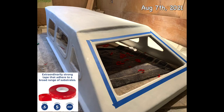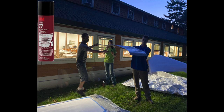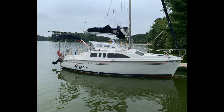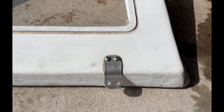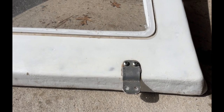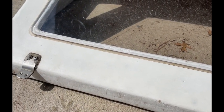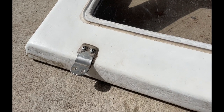To adhere the windows to the Dodger, I used 3M VHB tape and painter's tape to align the windows. I also used 3M spray adhesive to ensure that the self-adhering foam deck material would stay stuck to the top of the Dodger. Our final window to install was the aft window — it took special care and a few piano hinges to ensure no mosquitoes could find their way in when it was closed. One of the final challenges was to fabricate stainless tabs to secure the Dodger to the existing mounting holes of the original companionway hatch. Using the original hinges as a template, I bent the tabs flush on both the deck and the Dodger, then drilled and through-bolted them using backing plates and locking nuts from the inside, with butyl tape to leak-proof all of it.